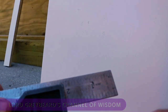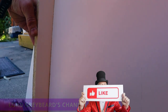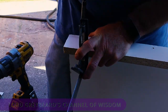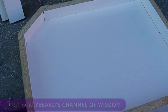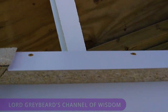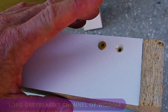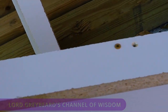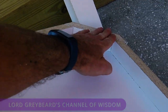To make sure I have an inch and a half, I'm going to use my combination square, dial it down to an inch and a half, and make sure the screw sets when I screw it to the form — it should give me an inch and a half consistent all the way around. I just got done building the first mold. We've got an inch and a half deep form. I did manage to mess up a couple of screws, but to compensate for a misalignment, you just drill next to it. It doesn't need to look good — this is just the form. You'll probably make a few mistakes in alignment, but the important thing is to get a nice even form all the way around.